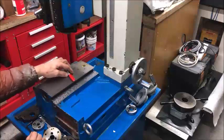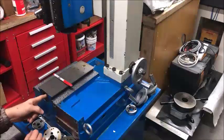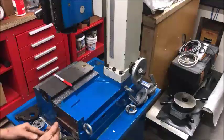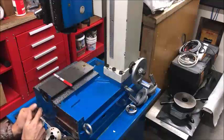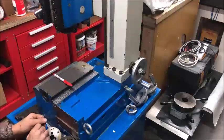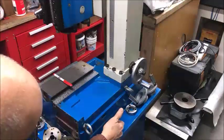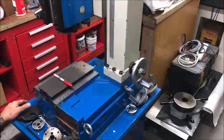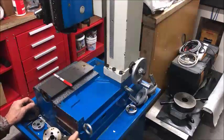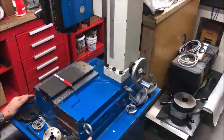Another thing we can do when measuring the ways is use the bore here. The bore in the casting should also be in line with this, but given that this is a budget machine, you can't really be certain that all these options are there for you, because they might not be precisely enough machined. Two-part casting — this sits on top here. I don't need to take off everything if I want to use this as it is; I want to level it, raise it up, ideally on three points, and adjust it so it is level.